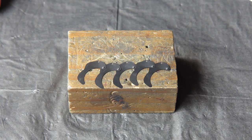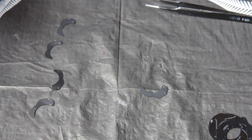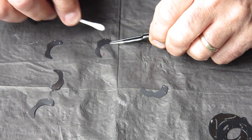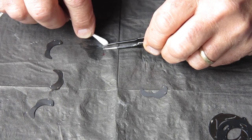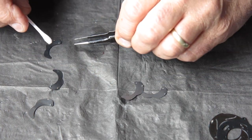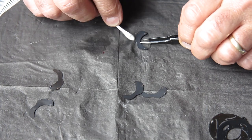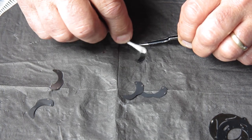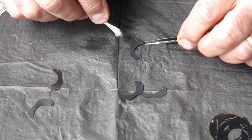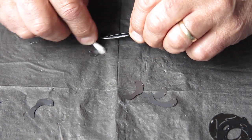You can see by the state of this cotton bud that there's quite a bit of dirt and oil coming off these diaphragm blades - these should all be nice and clean. There's a fair bit of dirt coming off. I can tell as I clean them that there's oil on the blades because the blades tend to have a shiny look when they have oil. As you strip the oil off with solvent, the blades take on a duller finish - more charcoal grey than black.